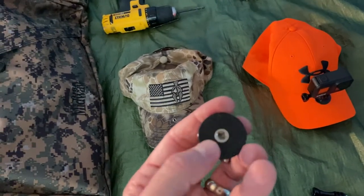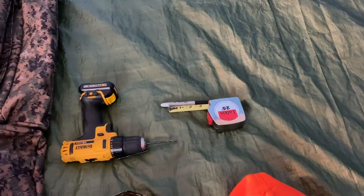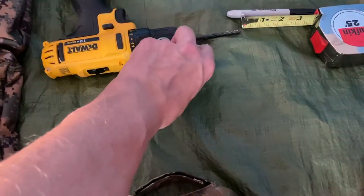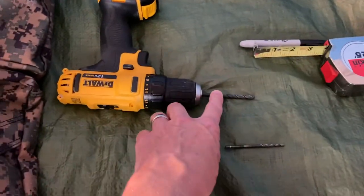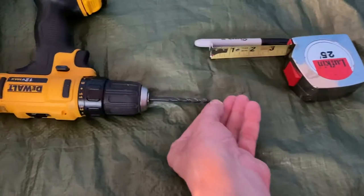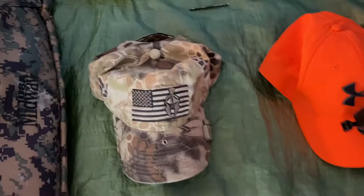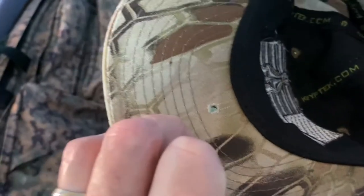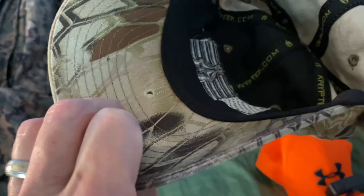Measure the distance from the edge to the center using a tape measure or ruler and a black marker. My recommendation is to start with a small pilot drill first to get your hole started after marking it with the pen, then use the bigger drill bit — slightly smaller than the quarter-inch bolt. I do this because I like to put threads into the cardboard in the brim so that when you screw it in, it works like a loctite. You don't need a lock washer; just a flat washer, and it never comes loose.